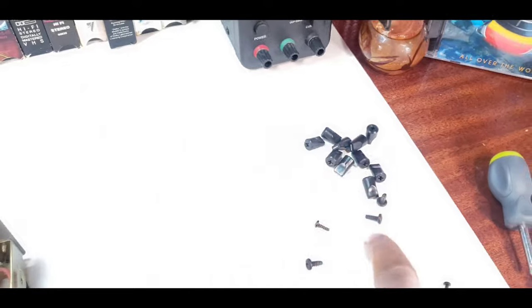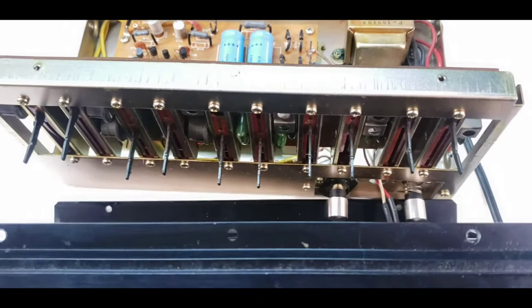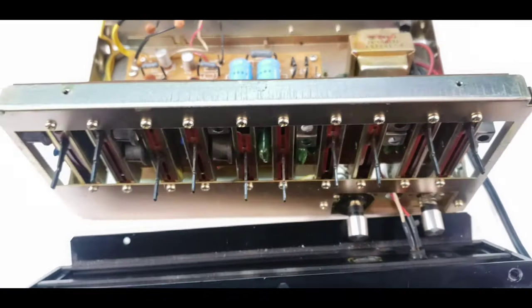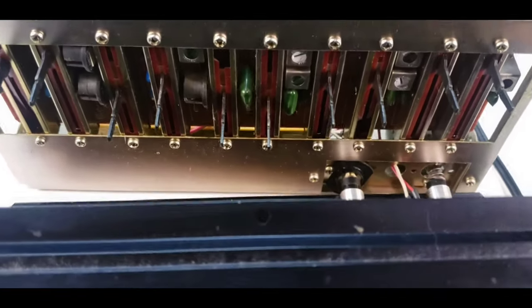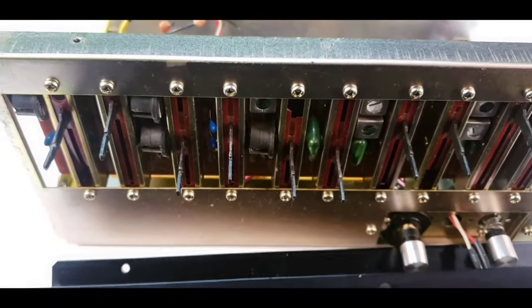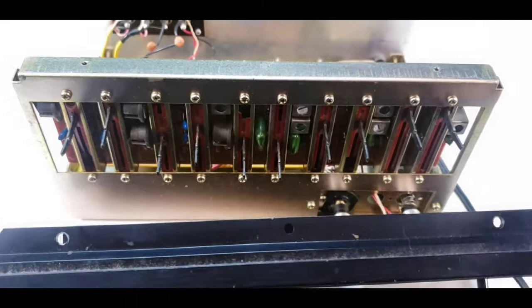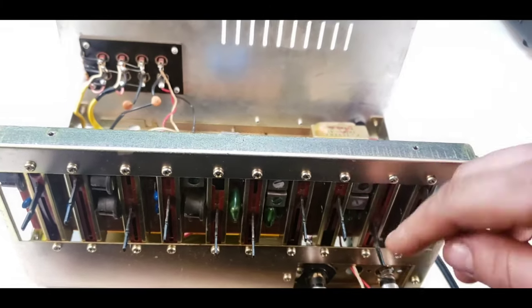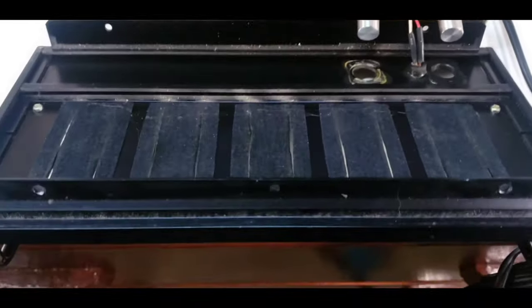It was actually quite simple — I'll just take all the knobs off the slide potentiometers. Then there were two bolts up top and two on the bottom. Although I can't really pull it all the way away from the chassis because the two leads for the LED are in there. I wanted to show you guys real quick how to clean these slide potentiometers. These ones are pretty good because you can get access inside between the little tracks and use some Deoxit, or WD-40 makes a pretty good product. Take the little red straw that comes with it, stick it in there, spray it really good, and move these up and down to work it in there.